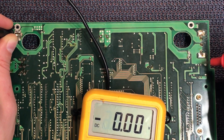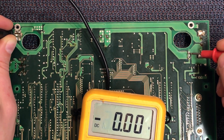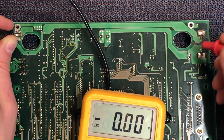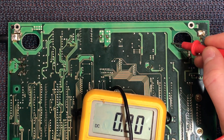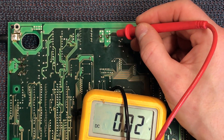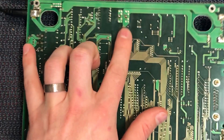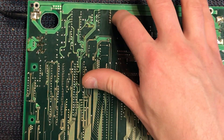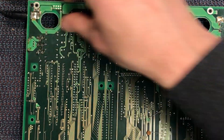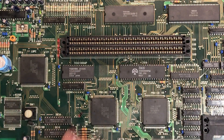The clean 5 volts comes down here along to the big cap - those two points are the main board capacitor, 1000 microfarad, which we'll probably swap out while we're doing all this. From that point right there, that's the clean, regulated, de-rippled 5 volt supply coming into the board. But as you can see, we've got a fundamental break in the feed into the board to begin with. I don't know if this is going to work once we fix the power issue, but we can only try.